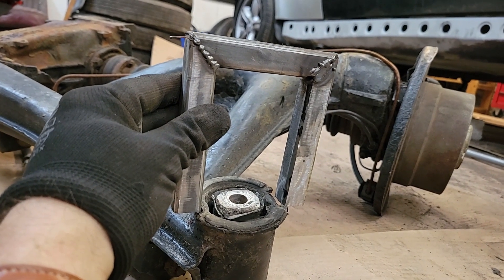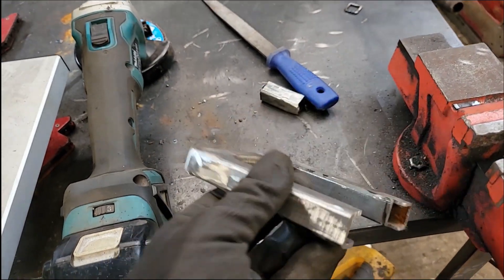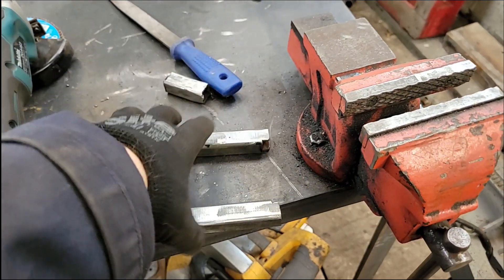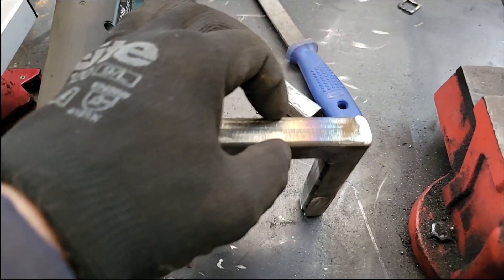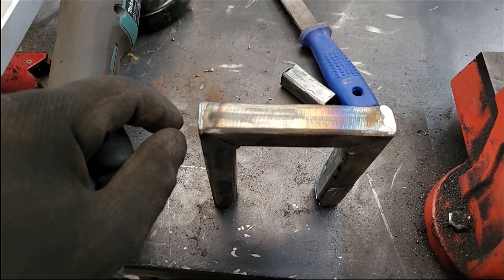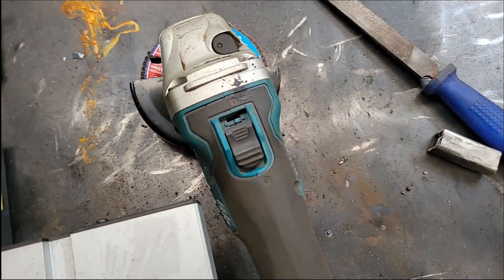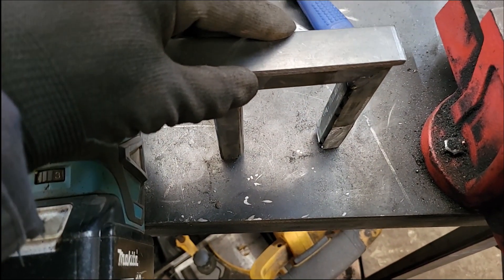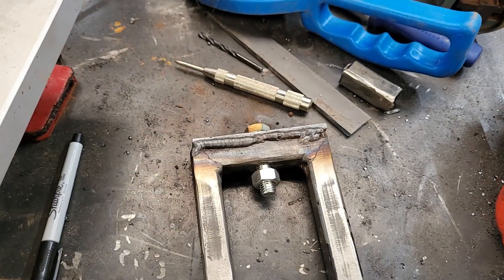And look at putting a hole in the top. Not pretty, but functional. I've ground down the welds just mostly to check if there's good penetration, which it seems to be. I've added a couple of steps there just so it locates in both directions and shouldn't slip around. Now I've got to add a hole in the middle. This is only 20mm box, so an M12 hole through the middle is going to make quite a difference to the structural rigidity. I've just got this off-cut of plate which I'll add to the top to reinforce it and stick a hole through there. A bit rough, but it's there — it's got the plate on top with some big heavy welds holding it on.